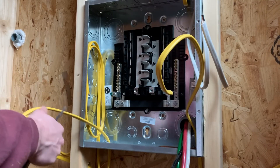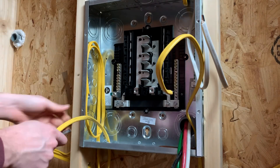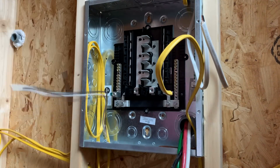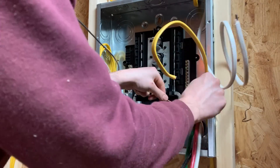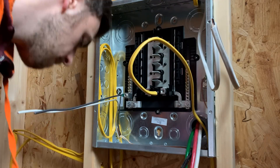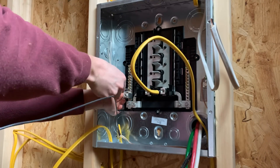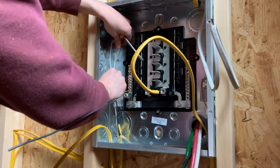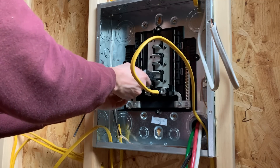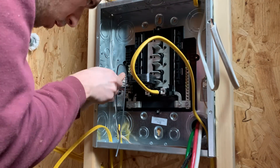Now I'm finally ready to start wiring up this panel. For the first circuit I'm starting with one of my dedicated outlets for the laser cutter. I'm stripping the sheathing back to expose the bare conductors for the wire located inside of the panel. I'm starting with the copper ground and mounting it to the ground bar here on the right side of the panel. Next I'm taking the white neutral wire and placing it on the neutral bus bar here on the left. You'll also notice that I'm folding the wire and leaving some slack inside of my panel if I ever need it. I'm installing the first GFCI 20 amp breaker into the box and connecting its white pigtail wire into the neutral bus bar as well.